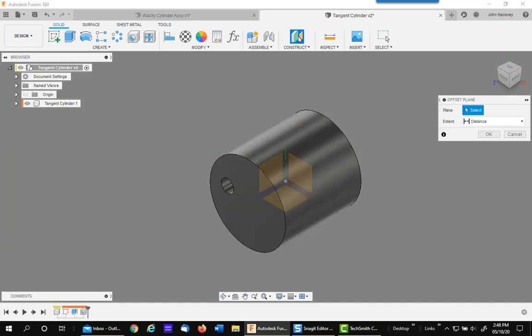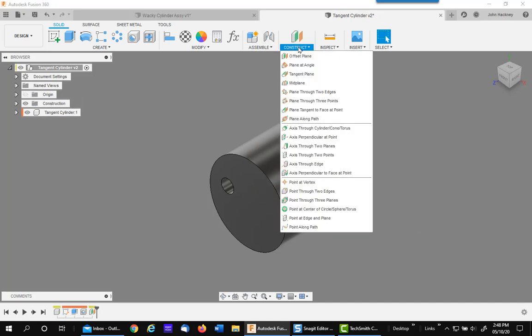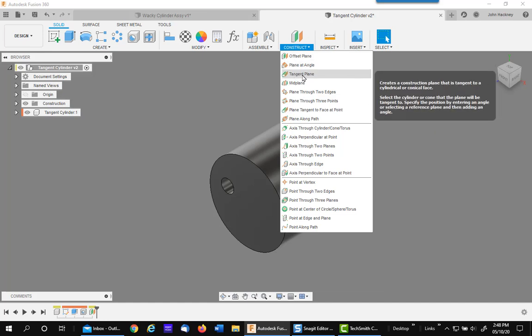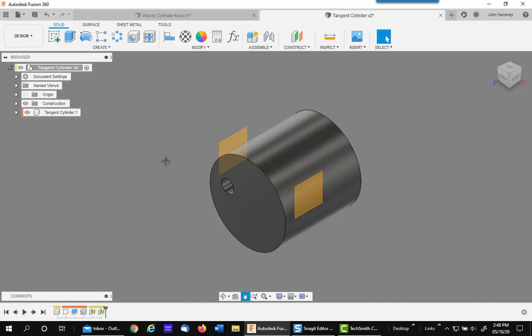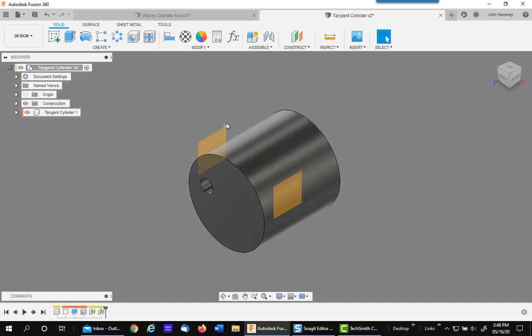To get these, we're going to need some work planes. So we've picked on the work plane tool. By the way, this is a three-inch diameter cylinder, so I want this offset to be 1.5 to make it tangent. I can use the tangent plane tool if I wanted, but I'm just going to use the offset one. This one will be on the back side at minus 1.50. We've got two planes to sketch on.